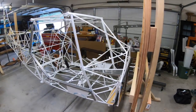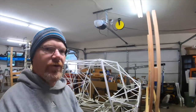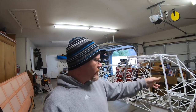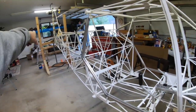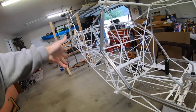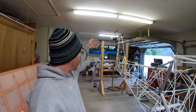I used these same stands I've been using for the wings. The reason I built the stands this way with the two parallel two-by-fours is so you can basically mount stuff to them in any position — they work as the wing stand when you're hooking the wing to the fuselage. One thing to remember when you do the rotisserie is to try to keep the pivot points as in line as you can. The tail is still a little bit higher, but I originally had it halfway up the rudder and that puts all the weight below the pivot point, making it very hard to pivot. The problem with it this way is the tail hits the ground, but I can move it up and down — it's adjustable with the clamp on that side.